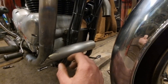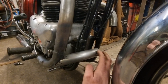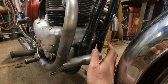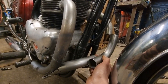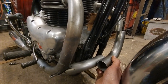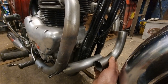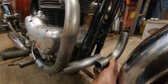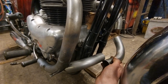My next plan, now I've got that piece made, is to probably make the joining collar, which would be like an inch and three-quarters. This is inch and five-eighths, so I'll make a little inch and three-quarter collar here which will join the two together when it's finished. I'll probably trim this one down over there — I want it at overlap stage. That's butted up square with that pipe on the left-hand side. I need to chop an inch off this one, and an inch off that one, then they'll both butt up to each other.